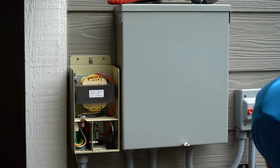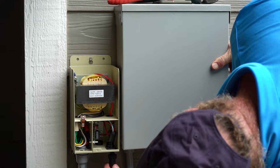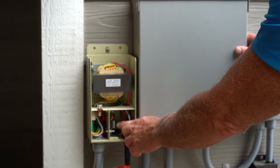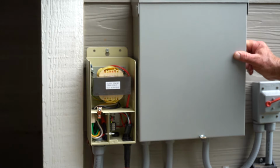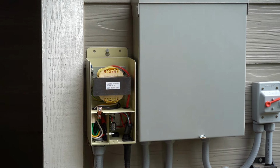After that little green light comes on, plug your cell back in. If that little green light goes off, that tells you you have a shorted cell and you will have to replace the cell. If that little green light stays on and you still have no power to your cell, again, your cell is most likely bad and needs to be replaced. It's as simple as that.